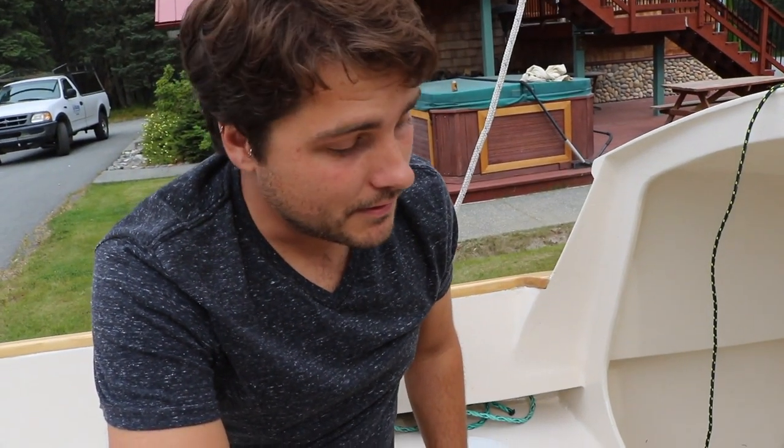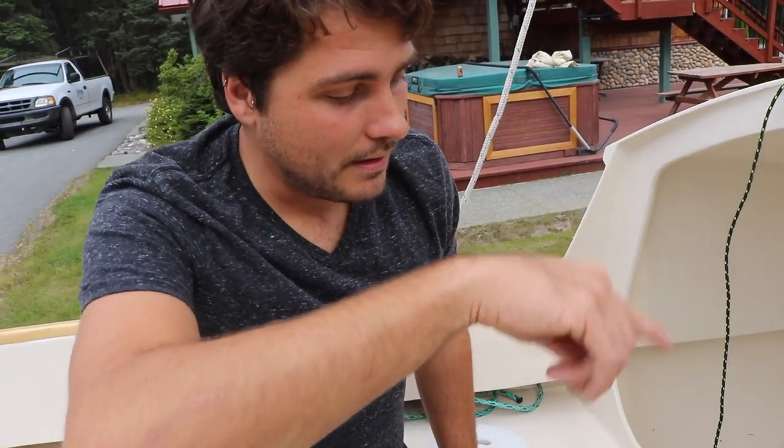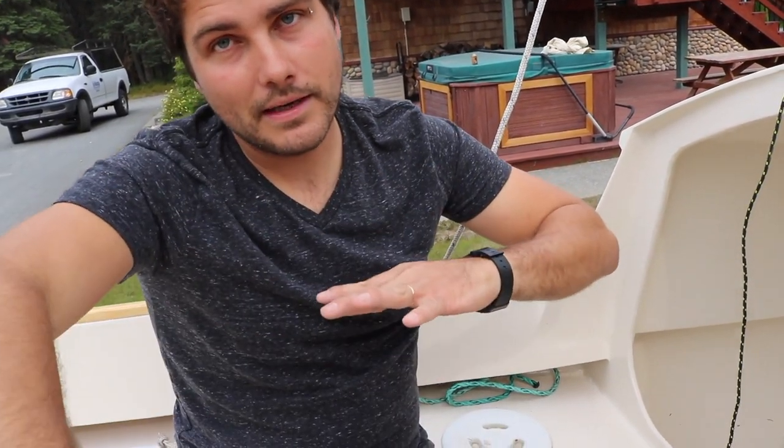We made the scarfs right by going to a CNC guy and having him cut a piece of aluminum at the puzzle shape we wanted. We flip-flopped it on two pieces of plywood — snap, bang, filled with epoxy — and now you have long plywood.